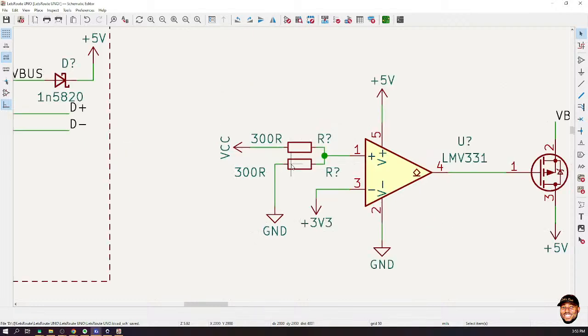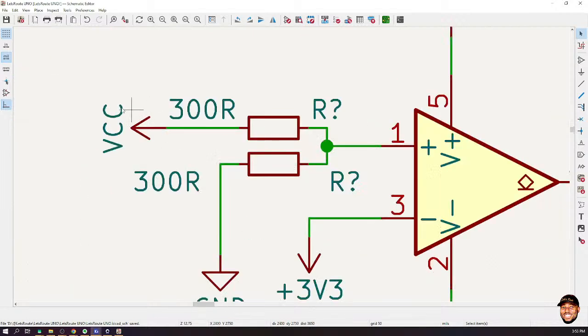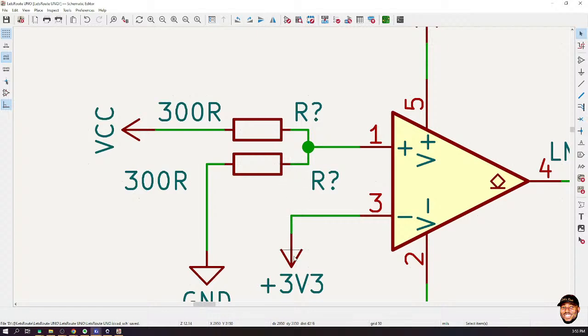But then when we connect VCC, let's choose this resistance. In this particular situation, I don't actually care about the current, but I need just a little amount of current, something in the microamp region, very tiny. What I need is the voltage that builds up across here to be higher than this 3.3 volts. So I can establish, let's say, 5 volts or 4 volts here, something higher than 3.3 volts. So let's try to drop 4 volts here. How do we choose resistors so that we can drop 4 volts here?